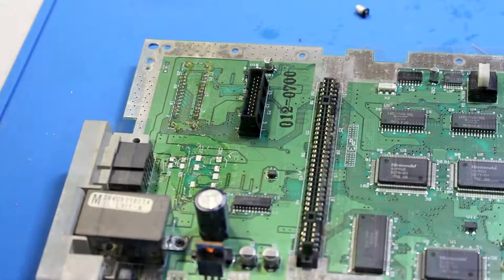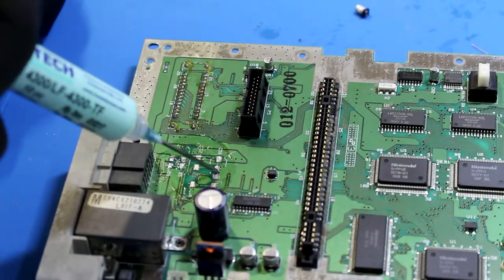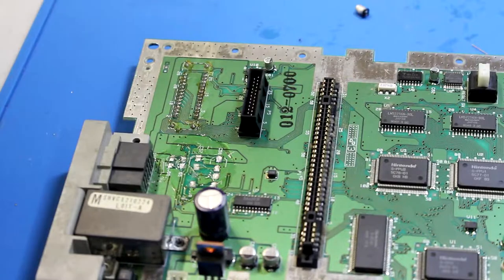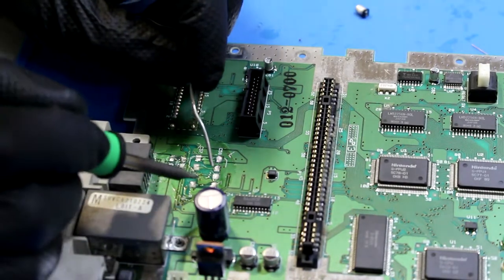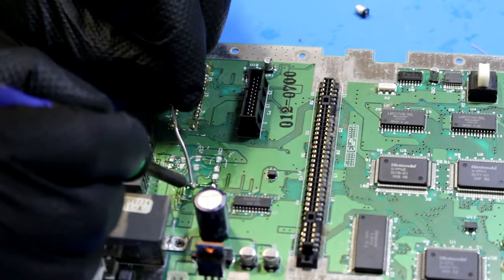I'm sure it will. So let's just cut the yapping and start repairing stuff. I'm gonna lay down some more flux, and with these being surface mount caps, and we're gonna use what are generally through hole capacitors, we're gonna make some nice fat solder blobs on the board, make it easier for the capacitor leg to stay or stick. So let's go ahead and do that now.